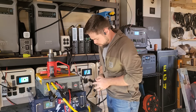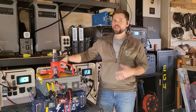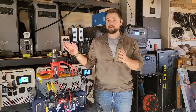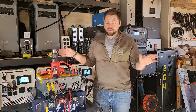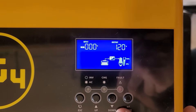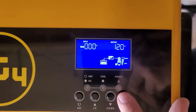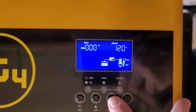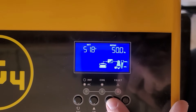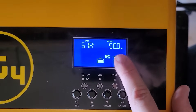I'm going to use a heat gun to put a heavy load on it. I also like this adapter because it has an indicator light that shows there's power. The screen is a little primitive — you have to scroll through it to get your input and output readings. But as long as you know you're not using more than 3,000 watts you don't have to worry about it. Scrolling through using the down button, we can see the AC output is on, we're not charging, and there are no faults. But it's still saying 50 hertz.